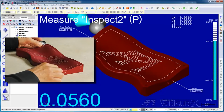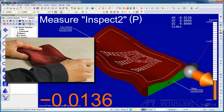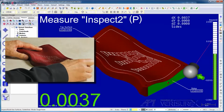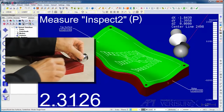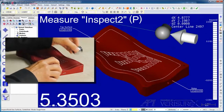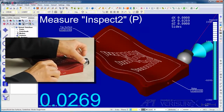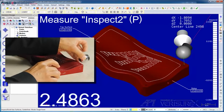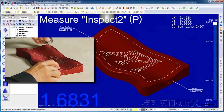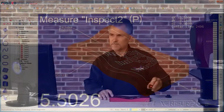I've enabled Use MBD Tolerance so we can use Surface Profile to control the build tolerance. In other words, as long as the surfaces are located within their profile tolerance, we'll consider that the part's in the right location. You don't have to get this to 0, I just want to get it within tolerance. It's green everywhere, so we'll call it good.